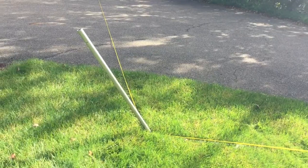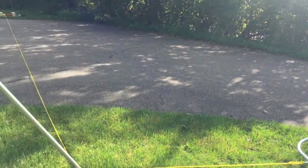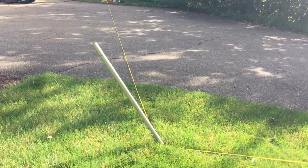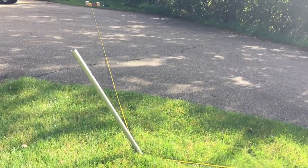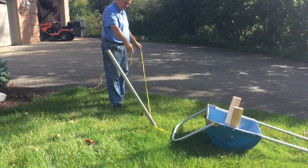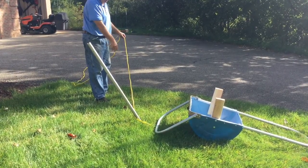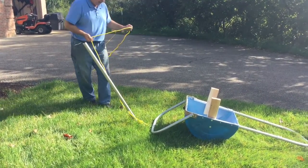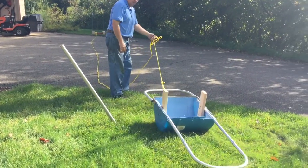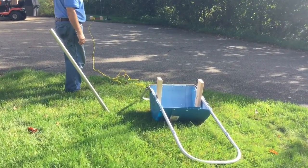Now when you get close to the post up here you have to stop the scoop, unwind the winch, and take the line off from this piece of pipe. Then you can come straight in. Now the scoop is brought up here — not tight, you don't want it tight up to this post. All you do is go back, unwind it, take this out like this, and now as you pull, the whole thing comes up straight and we wind up to the finish.